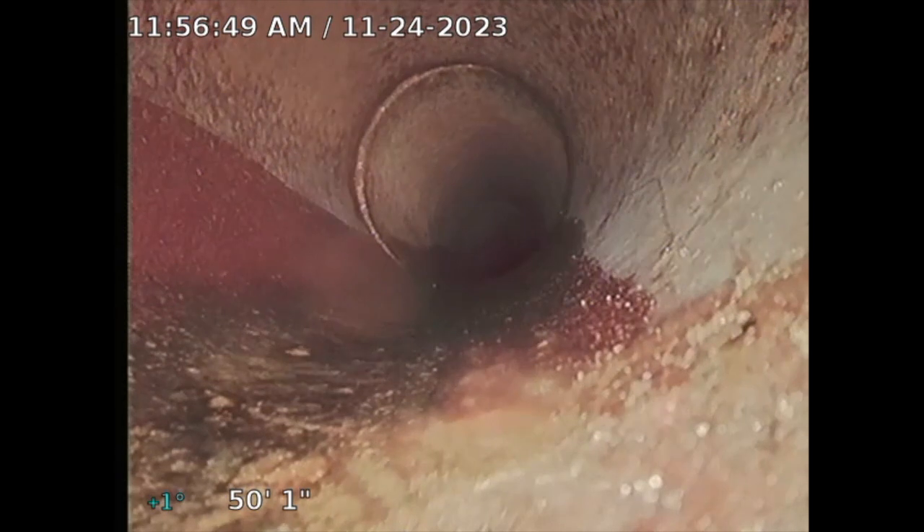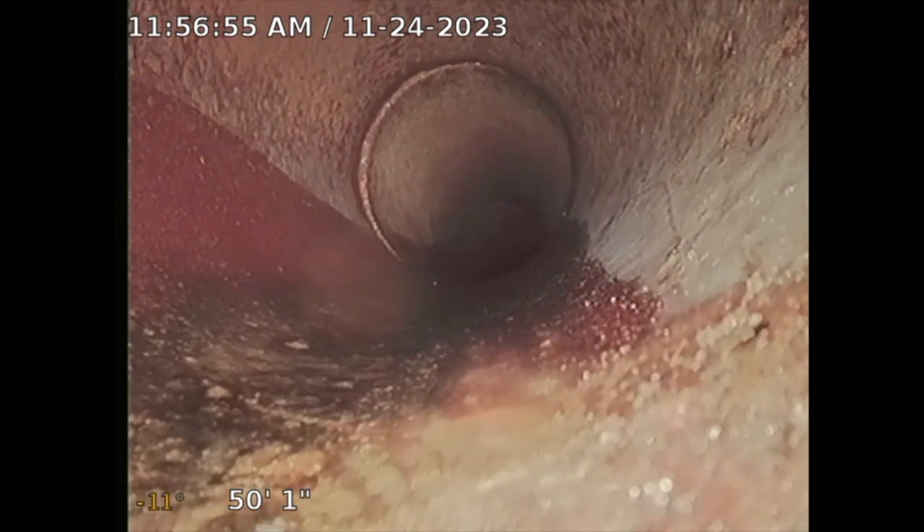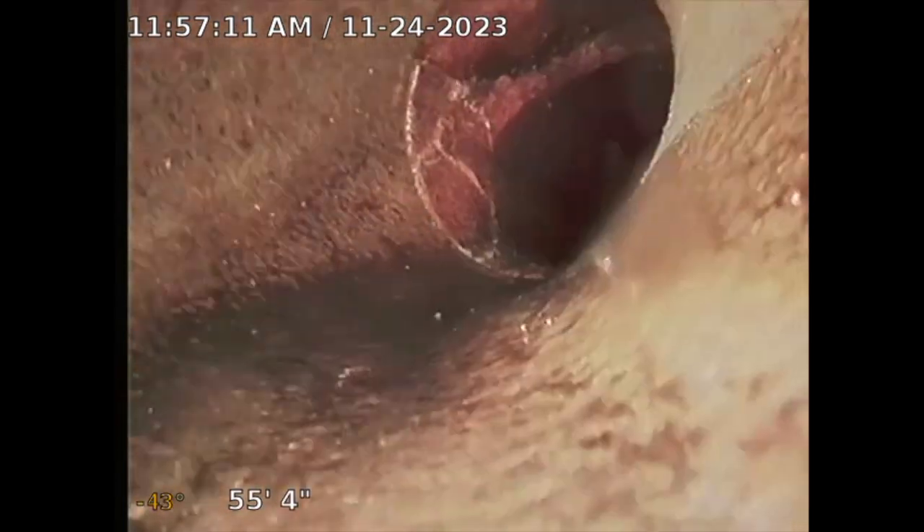See those multiple turns? There's a little hole in there — that's nothing. And then sometimes I'll turn on the water to help me push. Since I took off the skid, what this does is it lifts up the camera a little bit. But look at the diameter of this pipe — it's not a proper clean out, I had to take it off. So now pushing this camera is a little more difficult because it doesn't have that skid. But so far it looks good. See right there — a little bit of broken pipe. But that was probably done when it was originally put in.